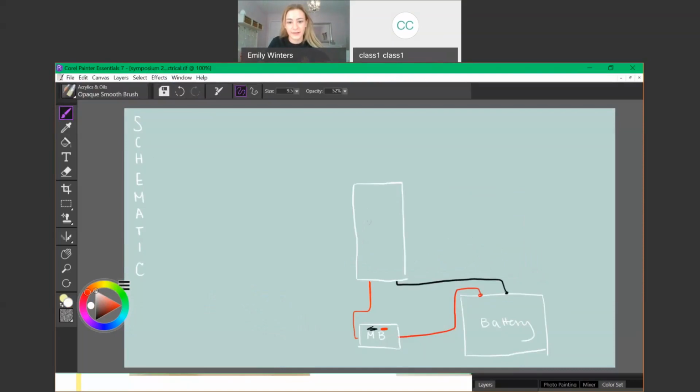And I'm just going to label it PDP, or power distribution panel. This is the end it connects to your battery. And then you've got your 8 ports over here and your 8 ports over here. And then over here it has some more connections that we'll get to in 1 second. And then over here is its CAN attachment place. So once we get to the CAN circuit, the PDP will be a major stop on that.